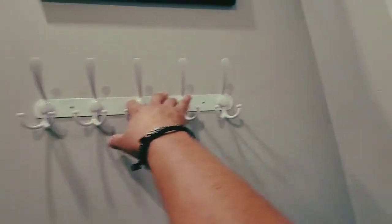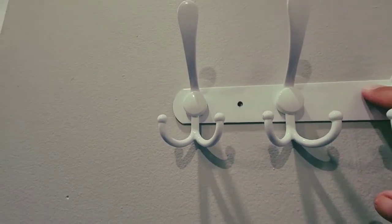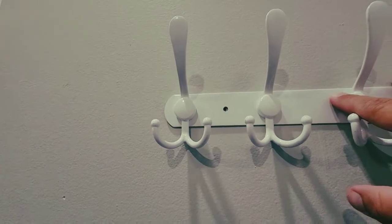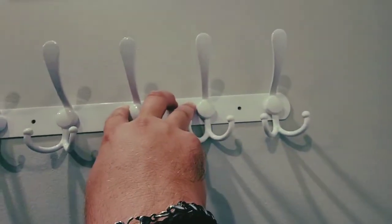So you want to measure nine and five-eighths on this side, nine and five-eighths on that side. You want to measure to the edge of the hanger, and with the carpenter pencil you mark where your screws are going. Does that make sense?